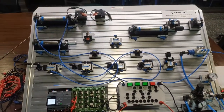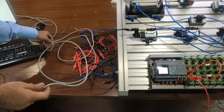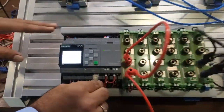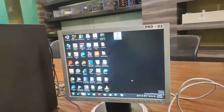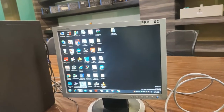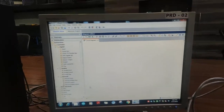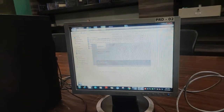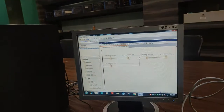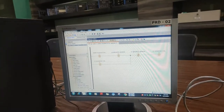We will use the LAN cable — one end already connected to the PC and the other end connected to the PLC Ethernet port. For programming we will use Logo Soft Comfort version 8.0.1. Making the program would lengthen this video, so we have already programmed the PLC. This is the program of the double acting cylinder using a 5-by-2 single solenoid valve. This program will be downloaded to the PLC using the download button.